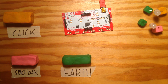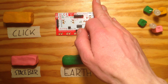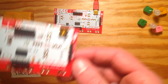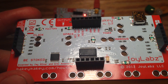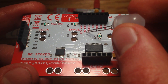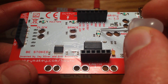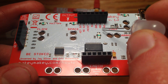The first and simplest way to light an LED with a Makey Makey is using the 5V pin on the back of the Makey Makey. If you look real close there, there is a 5V pin, a reset pin, an MS-OUT pin, and a KEY-OUT pin. PGD and PGC are for programming at the factories. You can ignore those.